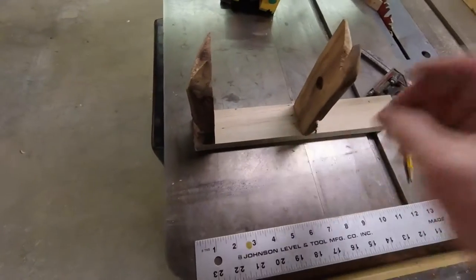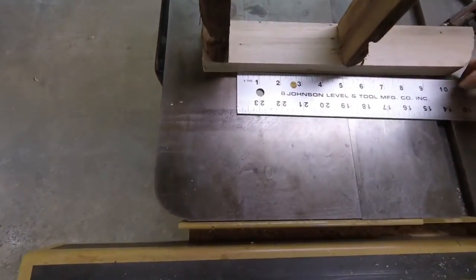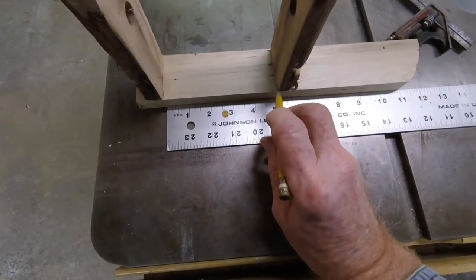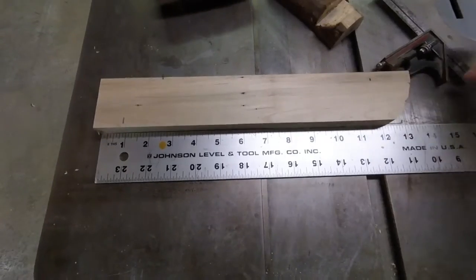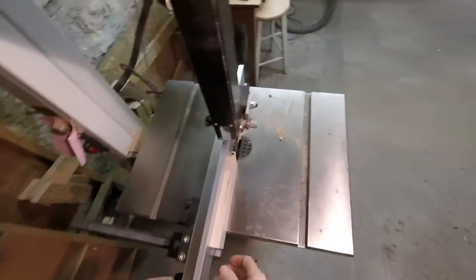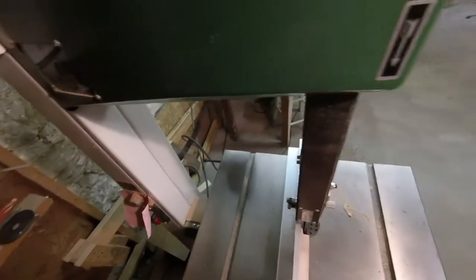I've determined I need five inches between the two heads. You have to take into consideration that this is going to be a dado on both sides, so start with this. I measure over five inches — that means my dado would be about here and the board itself will be here, which makes the board actually a little over seven inches long. The way to make these dados is to use the band saw — just be sure when you're cutting them that you flip it over and don't try going from one side to the other because it's offset.